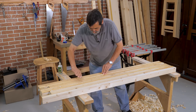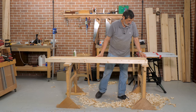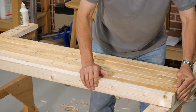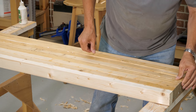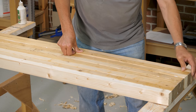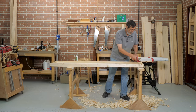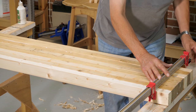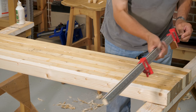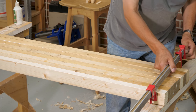So you're going to be cutting the ends off anyway. I've left enough length on my pieces, 3 inches, I think, or something like that overall. So when I come to the end of this, after it's set, I can go in with the saw, cross-cut the square ends, and then get my second length, cut the other end. That's it. So I'm going to put a clamp right over here because I know these are all level with the underside being on the bench top.